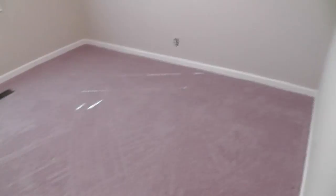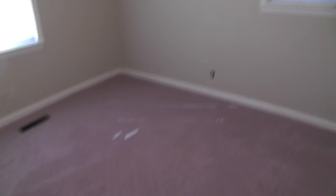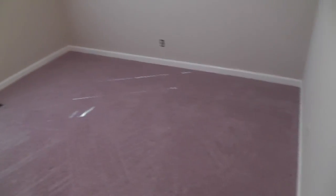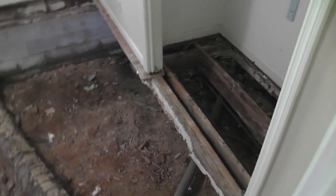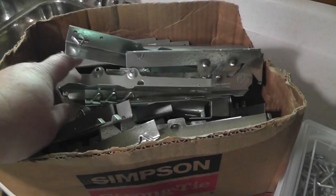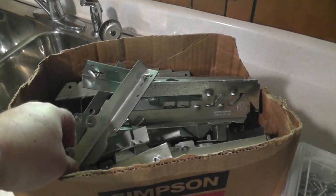This adjacent room is what it used to look like — very deceiving. You think it's just a standard room with nice-looking drywall and carpet. The room next door looked just like that, but the joists were all rotted out. You could walk across it and feel like you were going to fall in at any moment. What we're going to do is go back with treated 2x10s and joist hangers to make it extra secure.